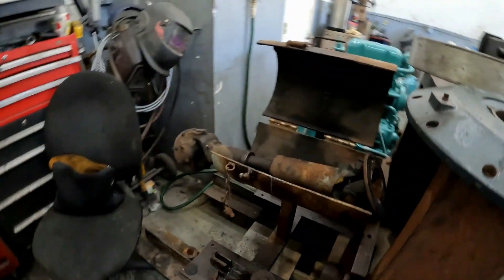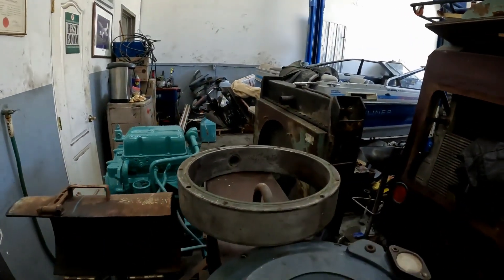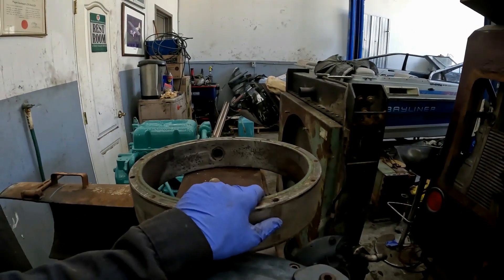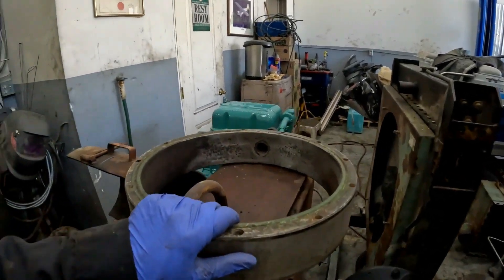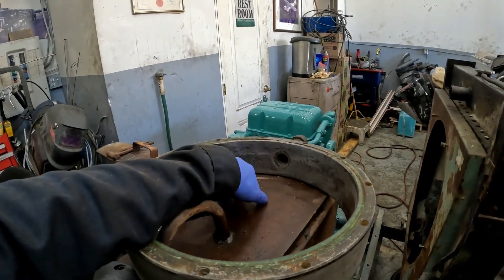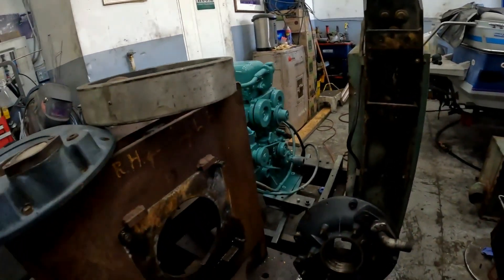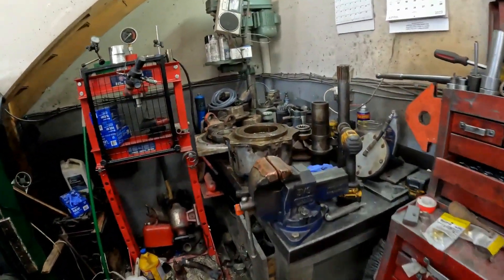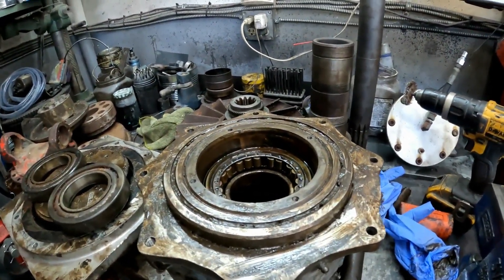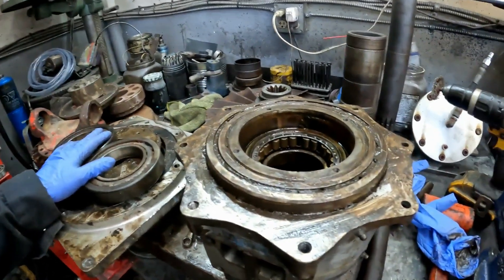After a quick diagnosis, I realized it needs a new bearing set and new seal set. This drum was totally gone. I contacted the manufacturer and they wanted a couple thousand bucks for it. So I just used a 70-14 rod and filled it in with an arc welder and repaired the missing cavitated pieces. That's fixed. What's left is just the bearings and seals.